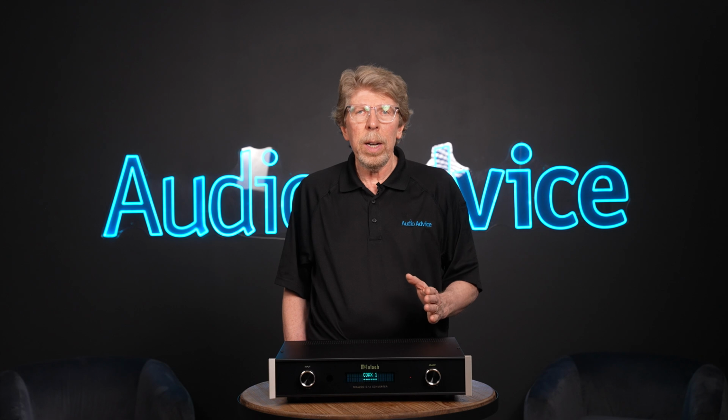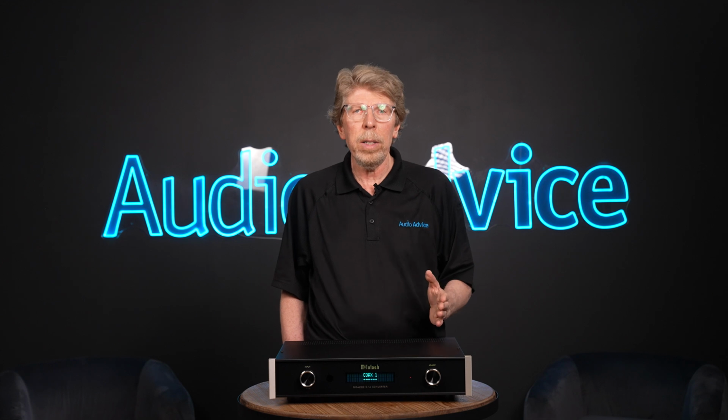The TV and the unit can then be set to accept CEC control, which means your TV remote will turn on the MDA200, select the HDMI input, and control its volume should you be using it as a digital preamp. This lets you get TV audio to your nice 2-channel system, greatly enhancing its sound.